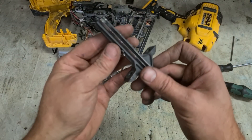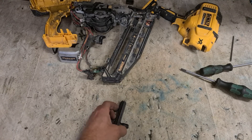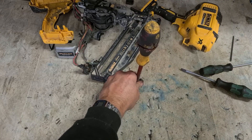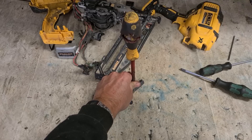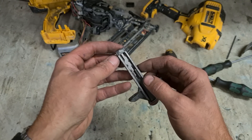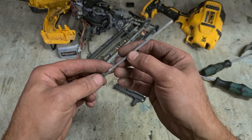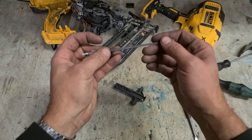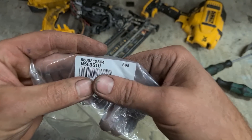Now, I'll show you how to change it. There's the pin — there's a wee wedge holding the pin on. All we need to do is get a flat screwdriver and straighten this little wedge. That wedge comes out and the pin will then fall out. Not just any pins are going to fit — you have to put on the right length of pin for this gun. Stick the model number into Google and that will show you plenty of suppliers selling these pins — costs about 20 or 25 euro.